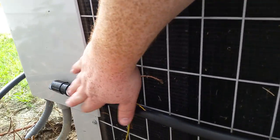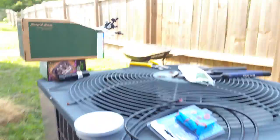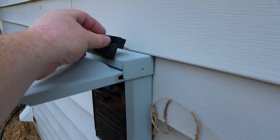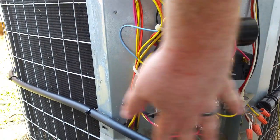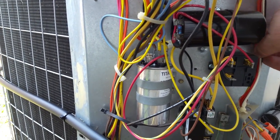The hose goes around and ends with a plug for the end of the connection. Now I'm going to remove the electrical cover and go over the thermostat wiring and how to make this solenoid work. Remember — anytime you remove that cover, always take out your disconnect or fuses. What we're looking for: this is all the high voltage stuff here, we don't need to mess with that. I've also got a 521 hard start kit. This is the thermostat wiring.